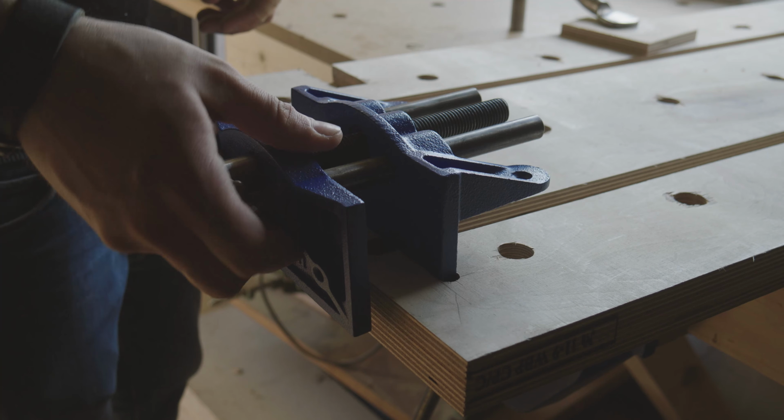Because we often build very large objects in our company and space is very scarce, we do not use a workbench and work on beams that rest on sawhorses. The beams are screwed together from strips of blockboard and are therefore very light, but nonetheless very rigid. This way you remain flexible and can move your workplace around or put it away to save space.